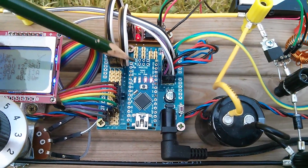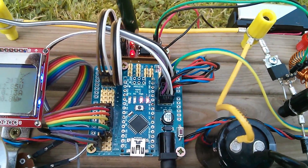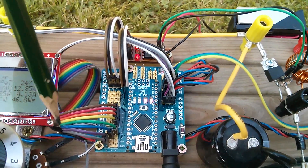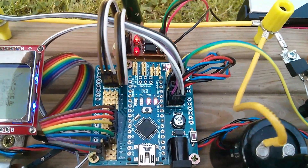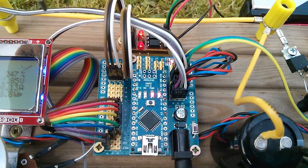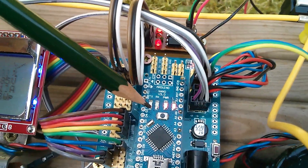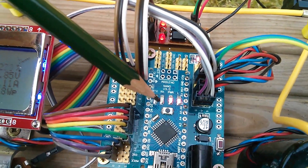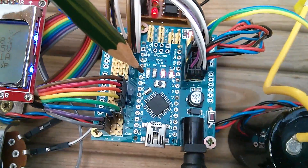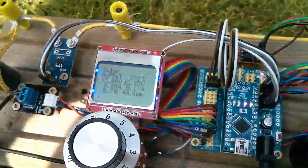The purpose of night mode is to put the Arduino into a very low power, low current mode. Various things we can do here, including slowing down the Arduino's clock. There's also this decoy driver with its two LEDs — one of those is on at any one time, consuming about 10 milliamps. But if night mode is detected, you can actually switch both LEDs off by taking the digital output driving them to a tri-state mode, basically an input. And if I want to take night mode to its extreme, I can actually sleep the CPU — put it to sleep — and then every 30 seconds or so it could just wake up, check whether there's any voltage and current coming in from the solar panel, realise it's still night, and go back to sleep again, keep doing that until it's clearly dawn.